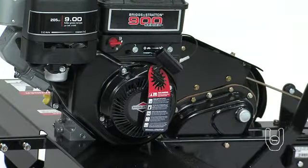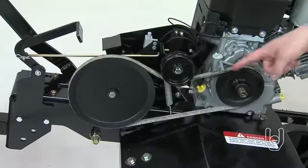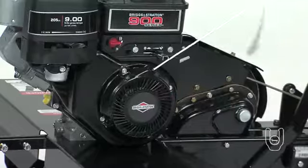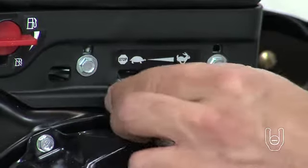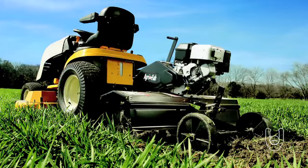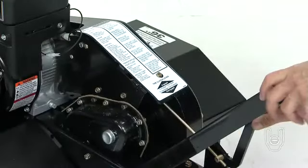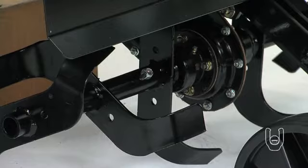Now wait a few minutes to allow the engine to warm up before you engage the tines. Note that before you start using your tiller for the first time, you should break in the belts, pulleys, and the controls first to make sure everything is operating properly. To do this, follow the steps to start the engine with the tiller attached to the tractor in the transport position. Then engage the tine clutch lever to start the tine rotation and allow the tines to rotate for five minutes. While they rotate, check the tine operation and adjust the tines if necessary.